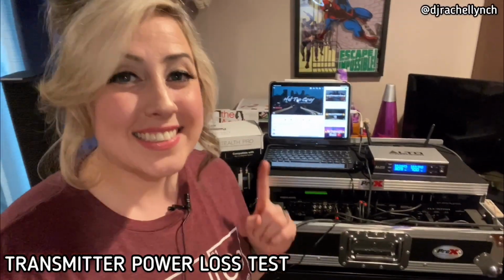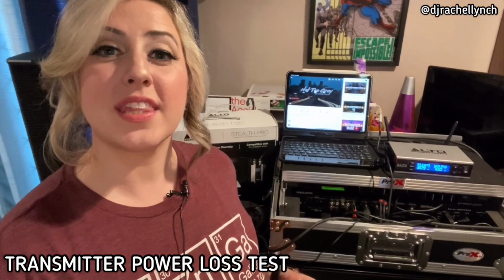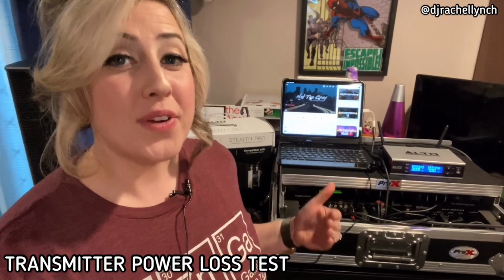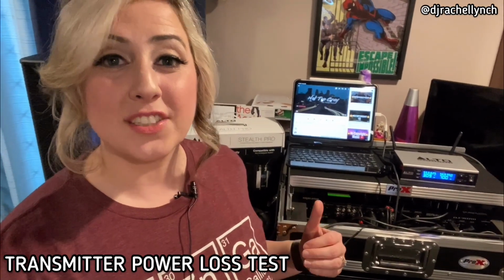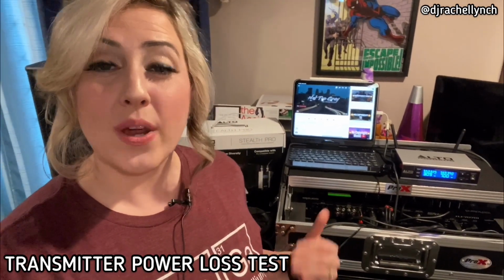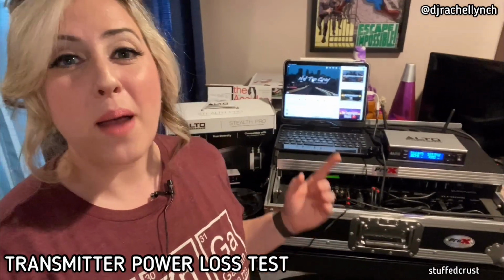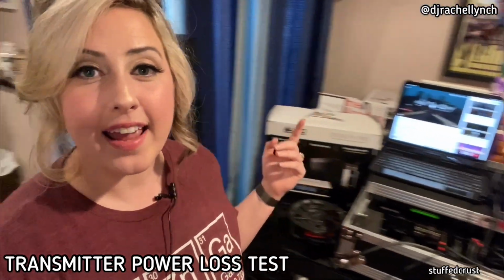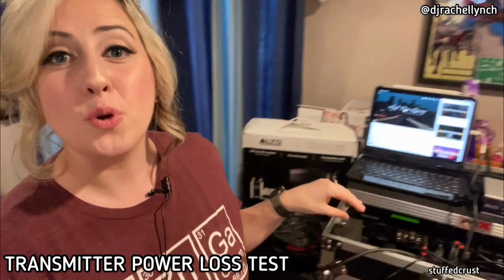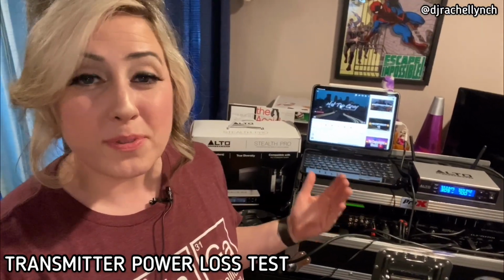This next test is a special request. I had someone reach out on Facebook saying that with the previous model, they lost power at the transmitter during an event, and it caused the satellite speakers to have a horrible static noise. And they wanted to know if the same thing happened with the Pro model. You don't know until you try. So I'm gonna play a track on my iPad. I have an Electro Voice Evolve 50 here with one of the packs hooked up. I'm going to pull the power out to make this turn off, and we'll see what happens to the sound.